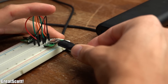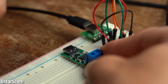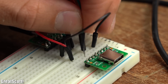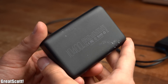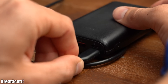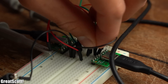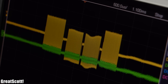After then using two USB Type-C cables to connect the power bank and the USB Type-C PD trigger board, it seemed like there was a problem indicated by the flashing red LED. Even switching the CC wires around did not help, but luckily I had another USB Type-C PD power bank lying around which, after hooking it up, cooperated with my setup. That meant it was time to connect my oscilloscope probes to the CC lines and press the push button a few times in order to record the sent-over data.